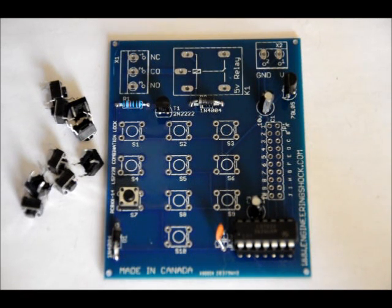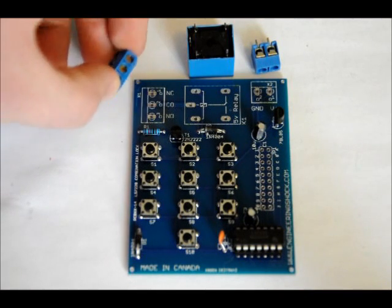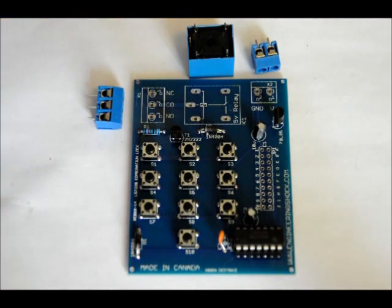Solder them all into place, and then we'll take one more step: solder the relay and the two terminal blocks. The relay only fits in one way — there are three pins on one side and two on the other. When you place it in, make sure you place a healthy amount of solder on each pad, since there's potentially going to be a lot of power along those lines depending on what you're powering. For the two terminal blocks, make sure the screw terminals are facing outwards, or else you won't be able to wire stuff up to this device. Solder everything into place with healthy solder joints.